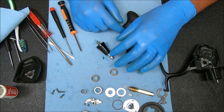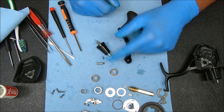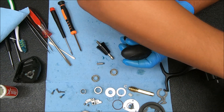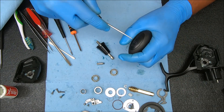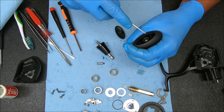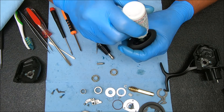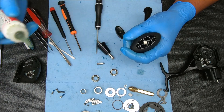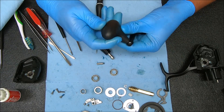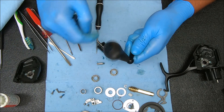Okay, now let's get our handle out of the way. I will show you how to put it back together, and obviously taking it apart would be that in reverse — only a couple of pieces there. One thing to note is that you can open this up: if you stick this pick inside it, you can pop that out, clean inside there, and re-add grease or oil. I'm going to use some oil around that spot right there, stick this back on there, and also add some oil right there. Work that in.